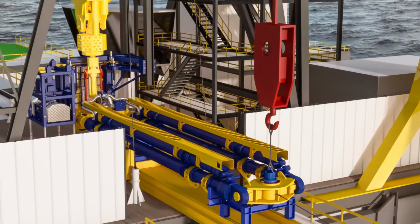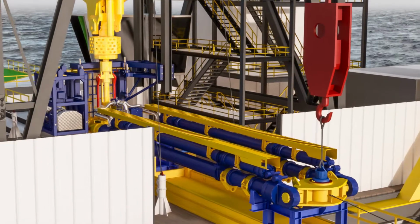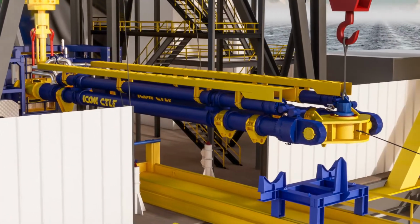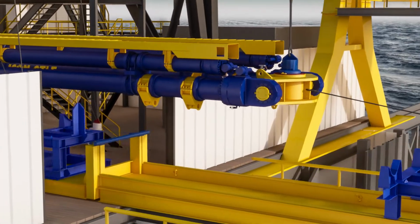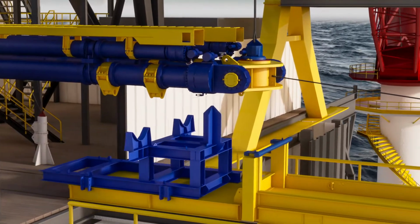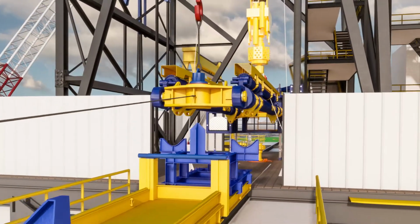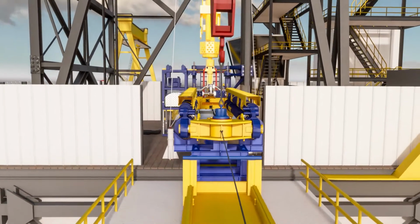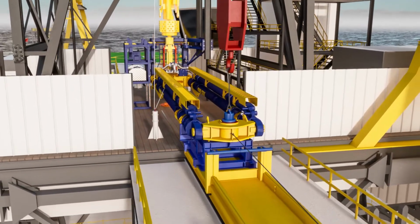With nominal tension applied to the support lines, the rig's top drive and starboard crane are hoisted simultaneously, lifting the CTLF clear of the riser skate support stools. The riser skate is then traversed aft until the forward support stool is beneath the CTLF's lower spreader beam. The rig's top drive and starboard crane are then lowered simultaneously, landing out the CTLF's lower spreader beam over the spigot on the forward support stool. The starboard crane can then be disconnected.